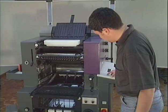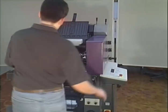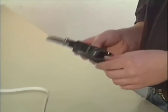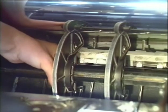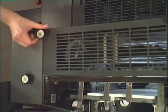The guide pulleys can be removed very easily. The groove in the shaft should point toward the delivery. Pull the spring clip and the guide pulleys can be easily removed from the press. The ink-repellent foil on the pulleys should be replaced from time to time. Put the guide pulleys back in and swing back the spring clip. The opening time of the chain grippers has to be adapted to the printed stock to achieve safe sheet laydown in the delivery.